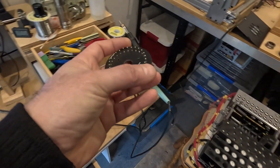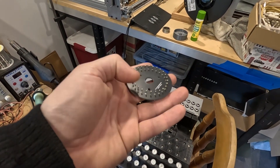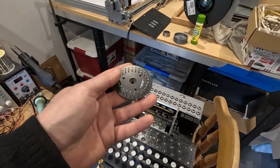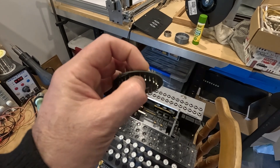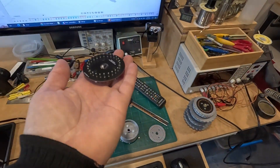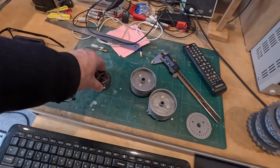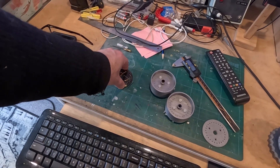In order to make the little springy pins I've been using these little pogo pins. These are used for testing printed circuit boards and they're relatively expensive, you need quite a lot of them and they're quite small. The other problem is I think the spring force on them is far too high, so in order to compress all of those little pins on the springs it takes a lot of force — over 500 grams. I tried measuring it and my little scales would only go up to 500 and it went into overload.